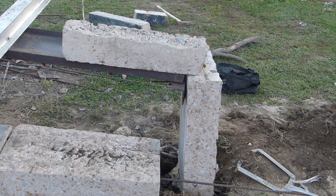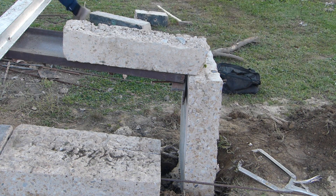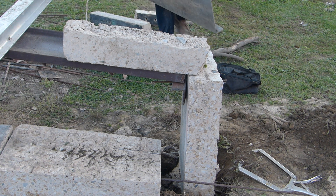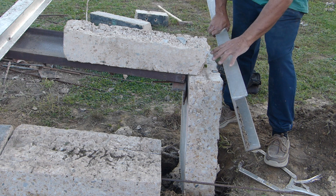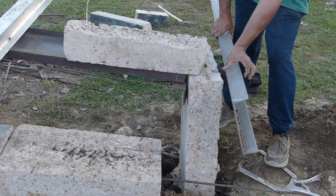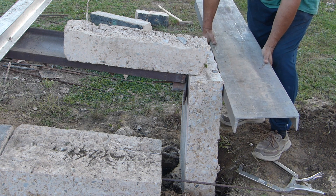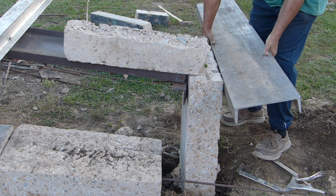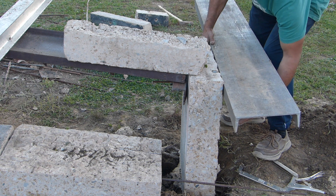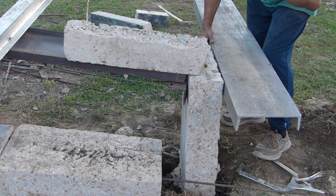If I can grab another piece of steel to help you understand the ledger — help you visualize more — so this would wrap around here, and this becomes the new head, the critical shear area. This extra lip becomes it. Now you could make it much larger, as you can see, and then brace it back. You wrap it around and now you've got a much larger head area here, bracing back into the column. This gives you a much larger critical shear area — to resist punching shear.